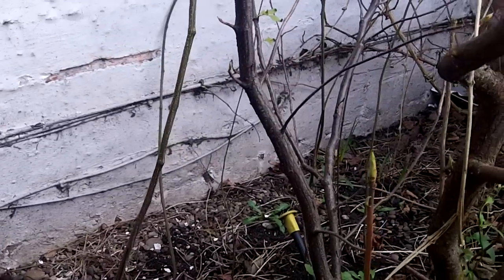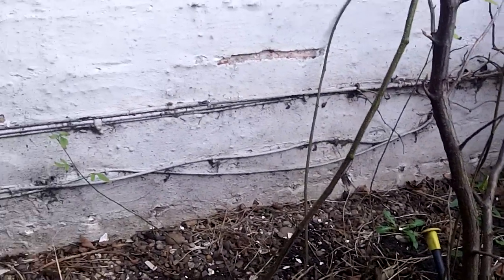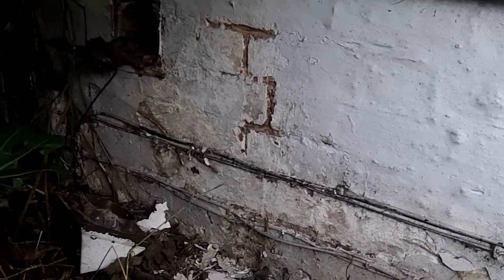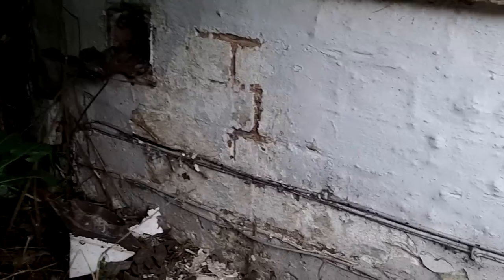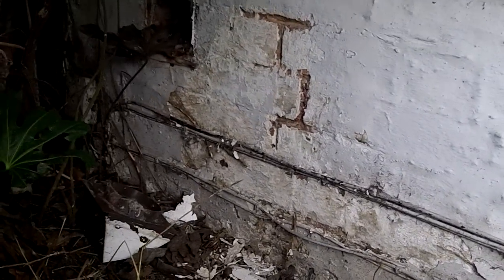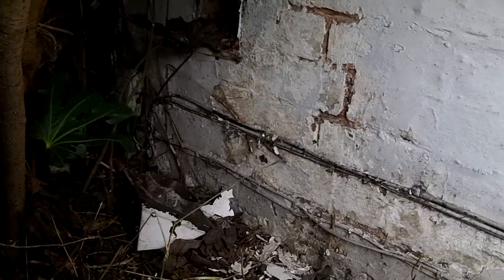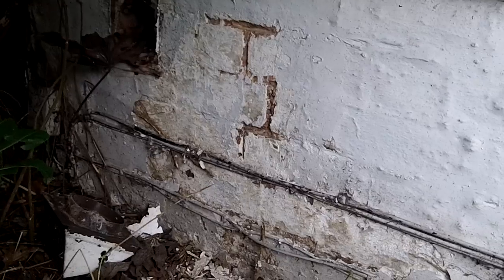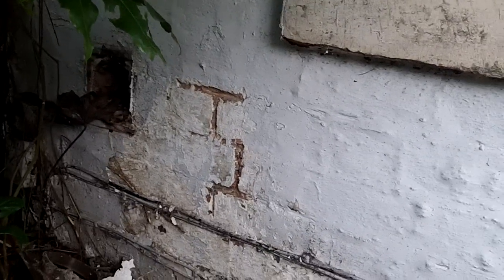The other thing we've got here is high ground levels. The ground here is just about at the height of the top of the floors inside, so it's not ideal. The wall here is covered in plastic paint and I've been chipping and chiselling it off. And wherever we've chiselled off, we've exposed quite wet, very damp lime mortar between the joints.